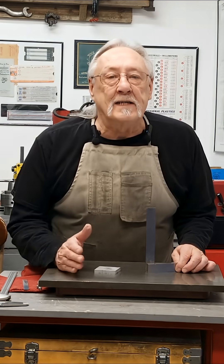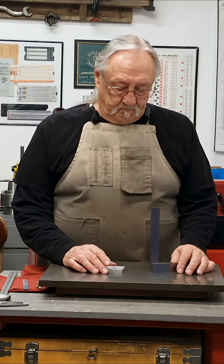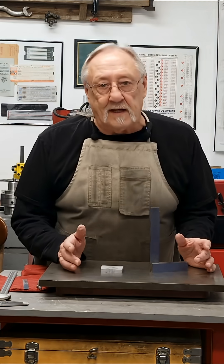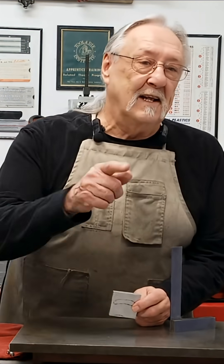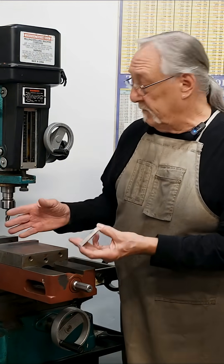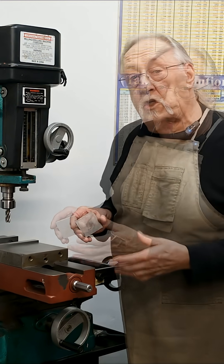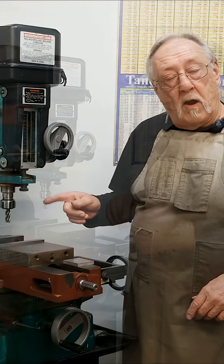This is beginner's milling. A friend called me — he had just purchased a mini mill and asked what he needed to know. I'd love to show him, so we're going over to the mill. The first thing you have to do is make sure that your vice is straight, because no matter what you do, if your vice isn't straight nothing's going to come out right. So the first thing I showed him is how to make sure it's straight with your ways.